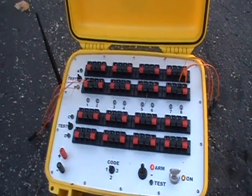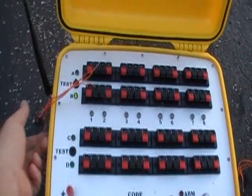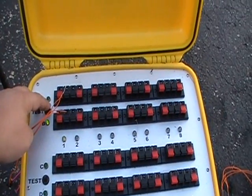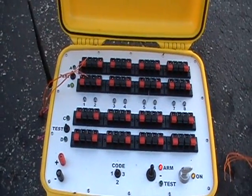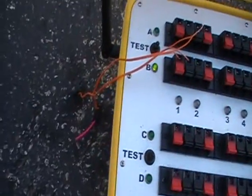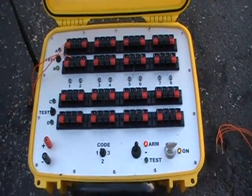What I'll do now is take the two that didn't go and run them back in series again and try them again on B1. So we've got the two that didn't go the first time in series again. We've got continuity. Fire. And you see again that only one went. The clip igniters do not work when they're running in series.